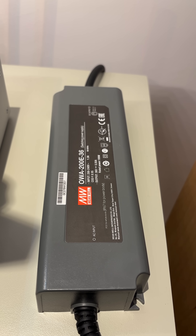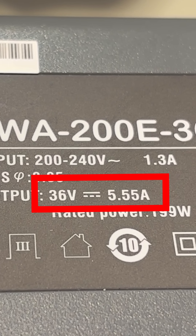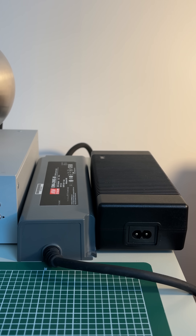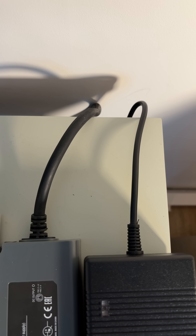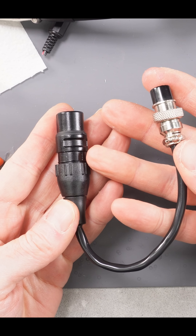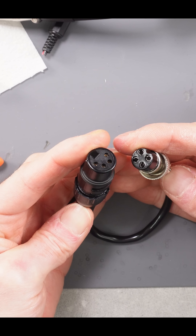The following option was a similar power supply but manufactured by Meanwell. These came from DigiKey and it's rated 36 volts and 5.55 amps — so no excess of amps here. It's smaller than the original but industrial in design, so it might not appeal to everybody. Its cables are also very chunky and it comes with an EU mains plug. Off I go making a different adapter, though soldering on a 4-pin XLR plug is much simpler than on a 5.5mm barrel jack.